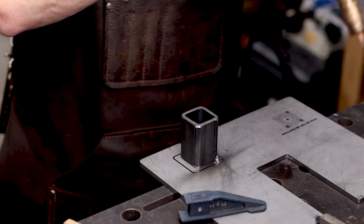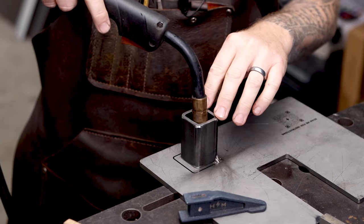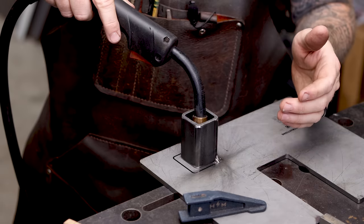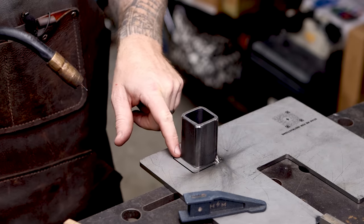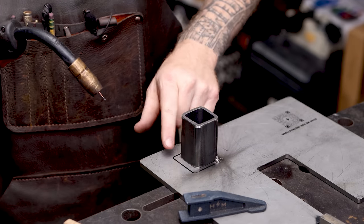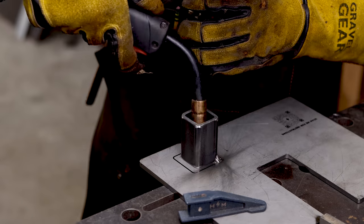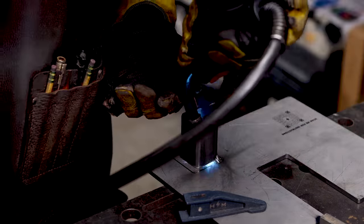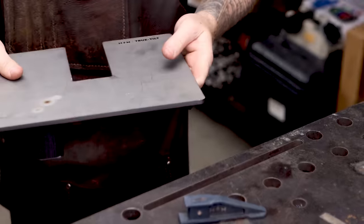We're back at the fab table now. Instead of putting welds on the outside, I'm actually going to put them down on the inside. With a MIG welder or stick welder you can get down in there and give it just these nice little tacks inside. The reason I'm doing that is I don't want a lot of built-up weld around the outside — I like the table to sit as flat as possible in that receiver tube. The welds down on the inside are going to solve that problem. Just tacked in each corner enough to hold it.